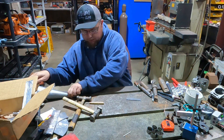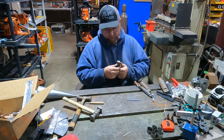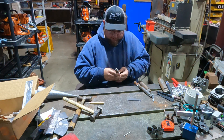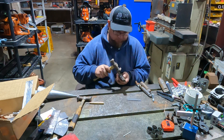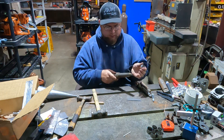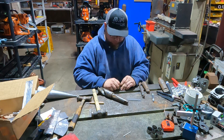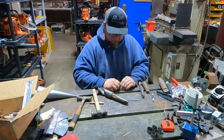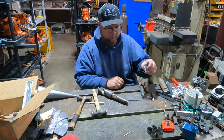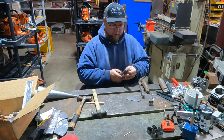I was using this one just folding it around. This is already on somewhat of a taper, so as we slide it down we can get bigger or smaller. Getting those ends a little bit closer — this is just 22 gauge material so it bends rather easy. I'll get these ends butted up, weld that seam on the TIG, and then finish making them nice and round before we assemble.